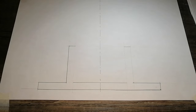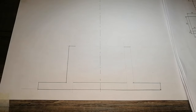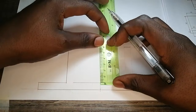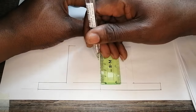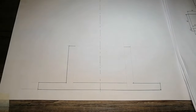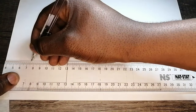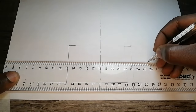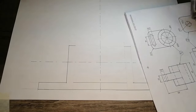Now get the horizontal center line, which is from here till there — 32mm. From here till there we must measure 32 millimeters. Come, put it here, this is your zero. Where is your 32? There is my 32, you mark there. After you've marked, you put your horizontal center line using your T-square: long, short, long, short, long, short, long. So this is the horizontal center line.